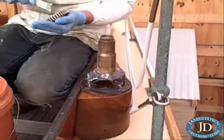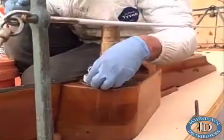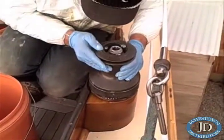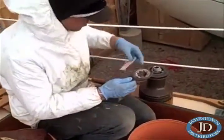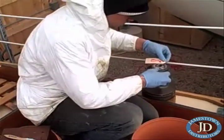Back on the boat, Peter starts by applying some grease to the center stem and begins reassembling the winch. Each piece is carefully reinstalled, being sure to keep all grease and solvents off of the finishes surrounding the winch. Once the drum and bearings are back in place, Peter refers to his notes to orient the feeder arm the way you like it.